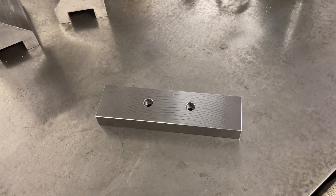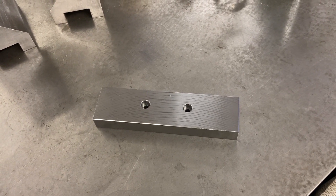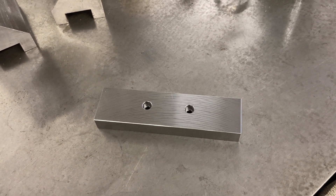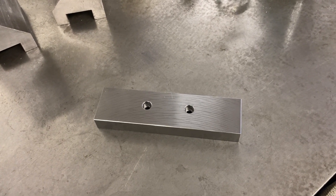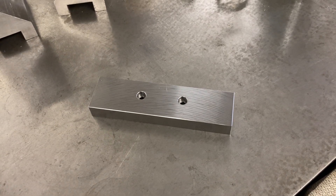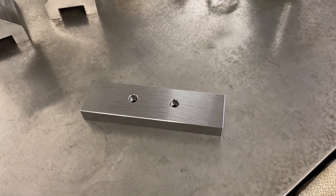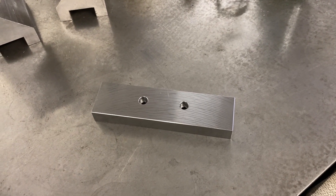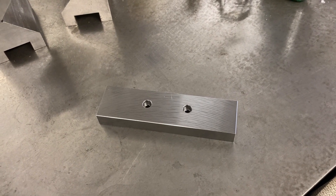Clearance for a 5mm socket head cap screw — it's not tight enough to use as a precise locator on its own. I want better consistency. I want my process in control. This way they're all the same length and we can bank off of one of the corners right there. I use that as a reference and run one after another, just load and unload the fixture.